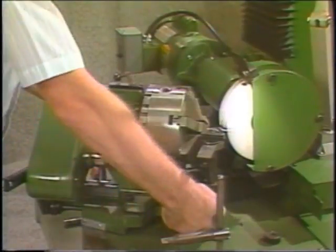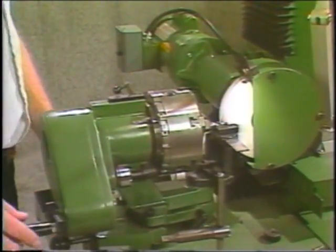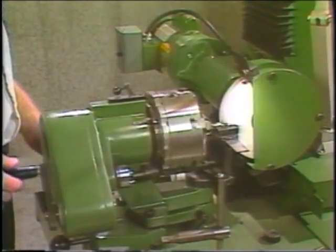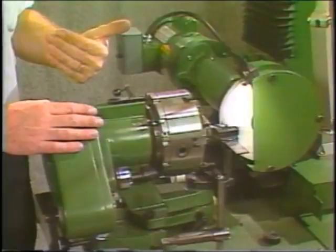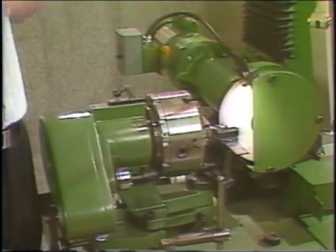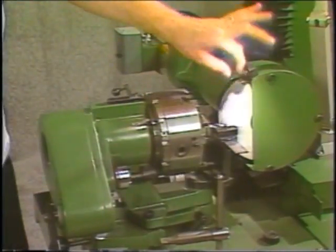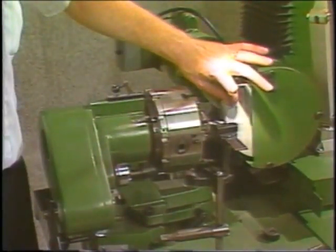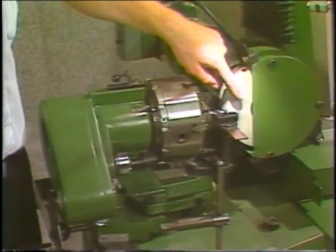Then you would set the drill straight, with the work head locked straight in, and then come straight down — feeding down the axis of the drill — so you don't get any undercut. If you do want a slight amount of undercut with this method, you're going to have to use a dish or cup wheel that's recessed on the side. You don't want a flat side on the wheel when doing this type of work.